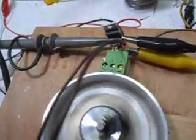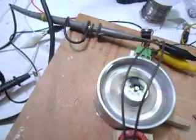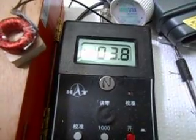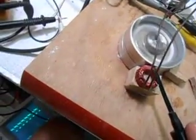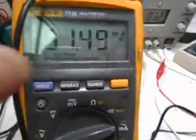Fed with the same trigger circuit as the Thomas motor. There's no magnet in here. And just to show you, I'm going to put my magnetic probe right here — and there's only about 3.8 millitesla or 38 gauss. It's really the field of the magnets coming by that's even causing that. There's no magnets in there at all. I'm running this thing on 3.2 volts at 51 milliamps give or take.